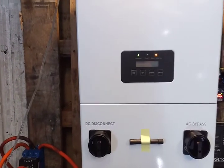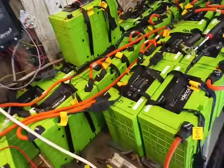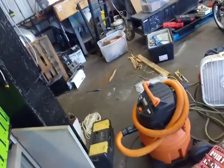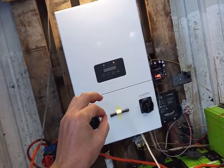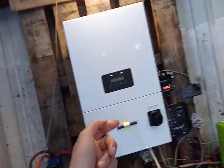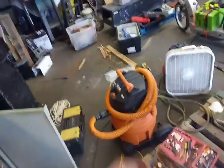Day two and three I can't get it to work with the batteries. One other thing I learned is that it pulls power straight from the solar panels — even with no batteries and no grid, it will send that power to the shop vac and start it. This thing draws 1400 watts continuously, and as long as I'm getting over 800 watts it will start the shop vac, which has a 6000 watt surge even though this inverter is only rated to surge at 3400. It will feed all the power it gets from the panels, which is enough to keep voltage up to 110 volts and make the shop vac sound lively and healthy.